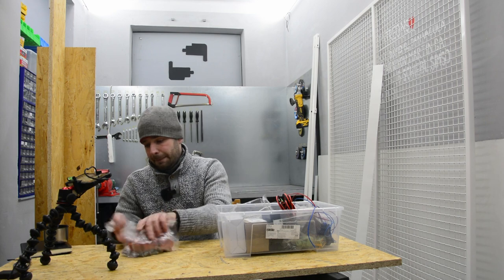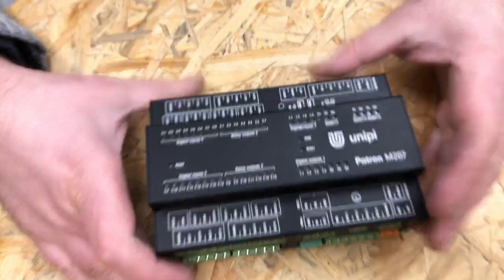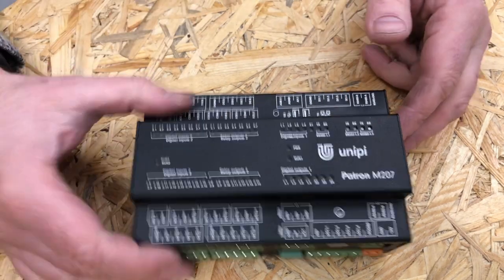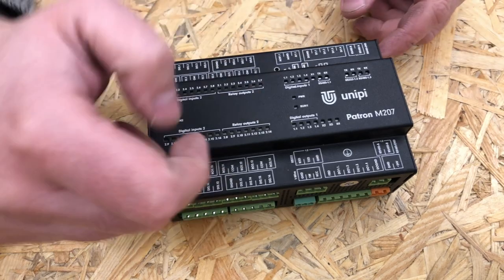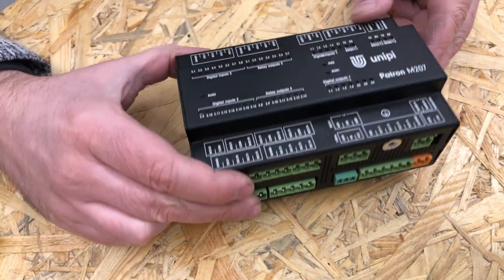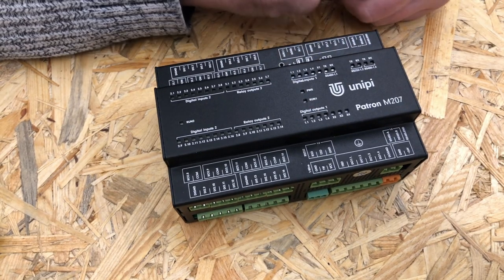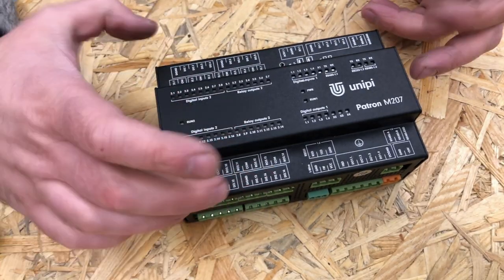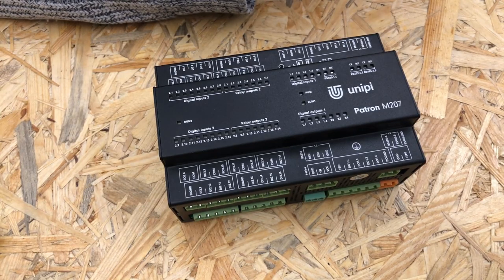And speaking of the logic, I also have the control unit. It's this one. This is a programmable logic controller, which is basically a computer which has inputs and outputs which are specifically made for connecting to sensors and actuators. So you have basic digital inputs. If you put some voltage across these terminals, the control software which is running inside of this PLC will recognize that there is something connected. So some switch is switched on, or some sensor is telling us, for example, the presence of a person in front of the door.